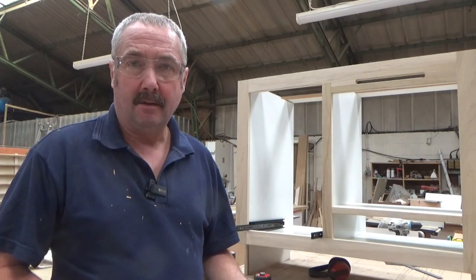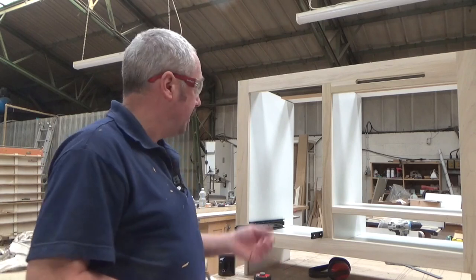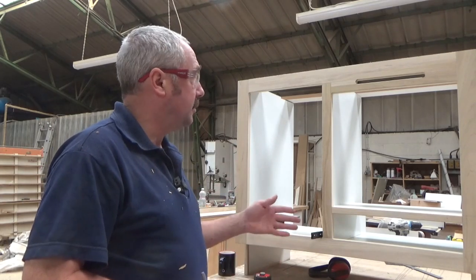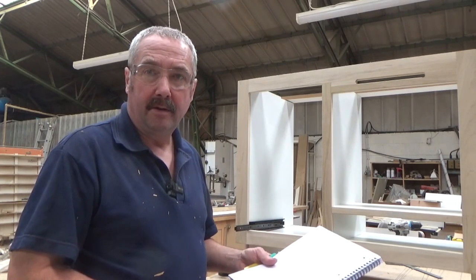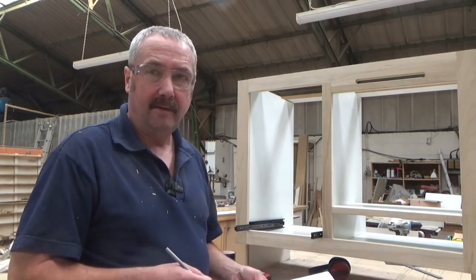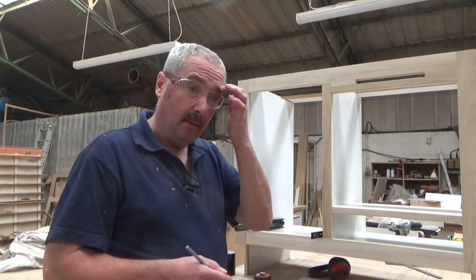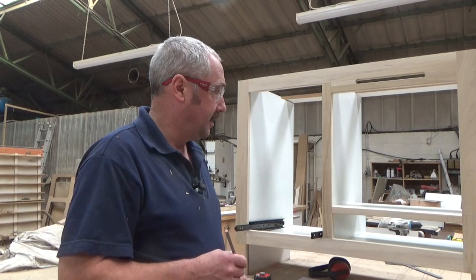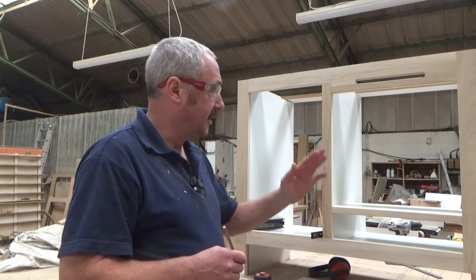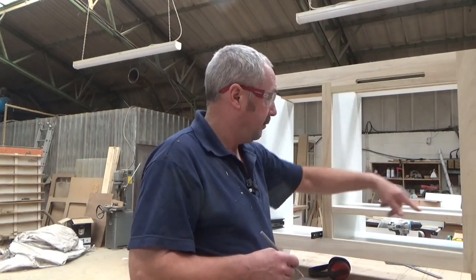Making drawers, you have to get set up to do them quickly, get everything set up and then knock them out. So what I'll do is, as I'm making the units, I'll measure them all up, and then at the end we'll have a day and we'll make all the drawer boxes. So I'm just going to get measurements for now, and then I can crack on with the units, because we will need to get those in on board shortly once the walls are done lined. So I've got my measurements for the drawers. I can make the end board for this, and I've got to put the aluminium round there, so I'm going to crack on, get them done and do all drawers at once.